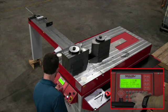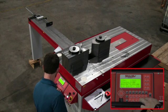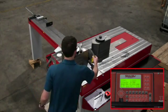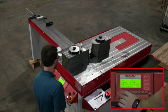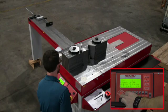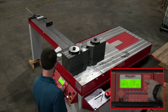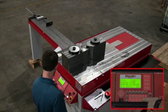You choose a name for the punch and then a name for the die. Right there we have the punch radius, which is actually 5/8 of an inch — I put half an inch in just for the quick testing I was going through, but it is 5/8 of an inch. Now we put the calibration block in there, which is .984 inches thick. We bring the RAM all the way up to the block and we tell the machine that that is where the zero point will be. We hold F3 until it says on the bottom that the punch stroke value is confirming the calibration block value.